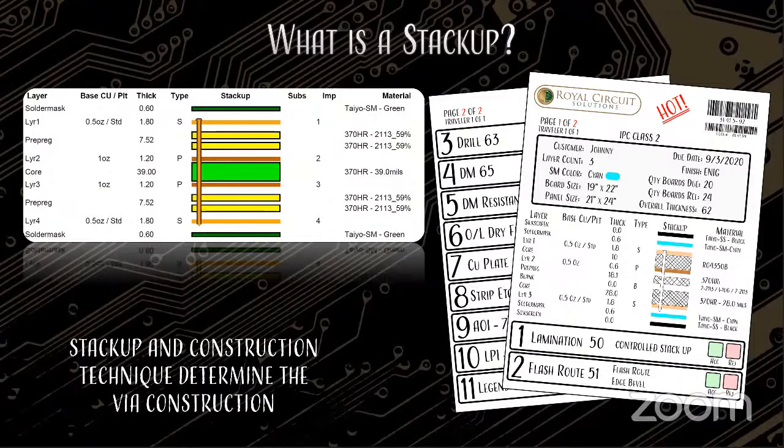I like to use the turkey sandwich reference. Essentially what you're looking at is two slices of bread, which is usually your top and bottom layers — your component side up and component side lower. Then all of the meat, tomatoes, and lettuce are all of the interlayers and interconnects in your stack up. Your stack up calls out materials, material thickness, copper weights, and impedance calculations. At the design stage, if your stack up isn't done right, every value you've slotted out for board performance is contingent on that stack up. Talk to your board house immediately — at the conception of the design.